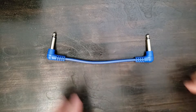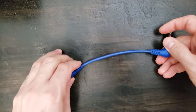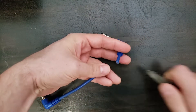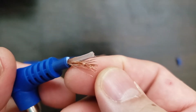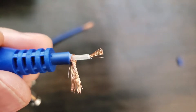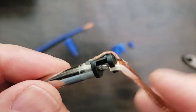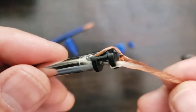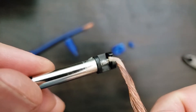But before we begin, let's take a closer look at a cheaper alternative. This is a house brand cable that usually costs around $5. The wound shield isn't too bad, but it is missing an inner semi-conductive layer for extra shielding. The inner conductor is also not bad for this price point. A big issue I see is inside the cable end where there's no shielding at the soldered point. This can allow interference into the cable, and in a high gain scenario, it could cause trouble.